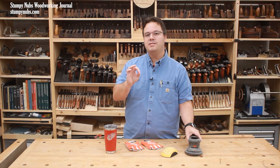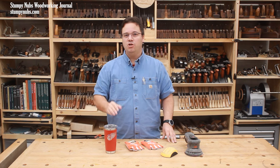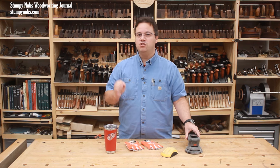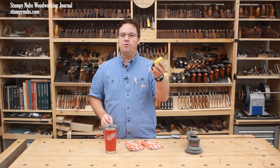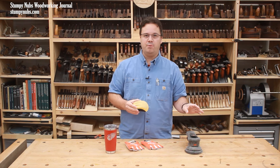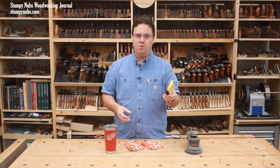You should always complete your project by hand with your finest grit. You work with the grain and that eliminates any cross-grain scratches that may have been left behind by the orbital sander. To that end, get yourself one of these — it's a comfortable foam sanding block that accepts the same sanding discs as your power tool, so you don't have to get separate paper. I'll pin a link to the one I use at the top of the comments section below. Get one — it's inexpensive and it'll be one of the handiest sanding tools in your shop.